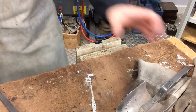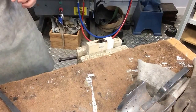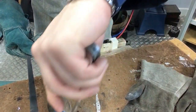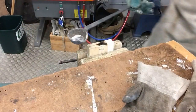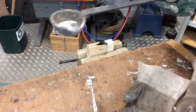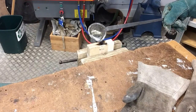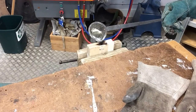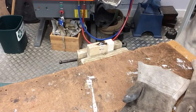I'm going to place the cast in the vise. One more time I'm just going to clean out the pewter — make sure it's nice and clean. I'm going to bring the spout of the ladle over the countersink and the sprues, and I'm going to very slowly fill it. Because when I can see it levelling, that's when I need to stop. Here it goes — and I stop now. I don't want to fill it any more than that, because if I do it will come out and go all over the room.